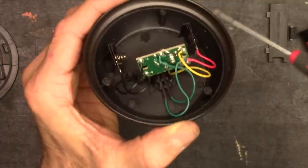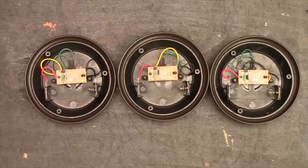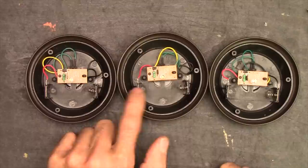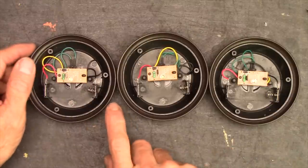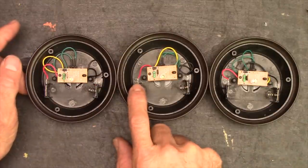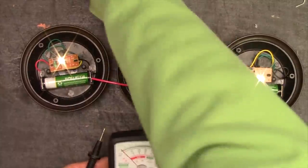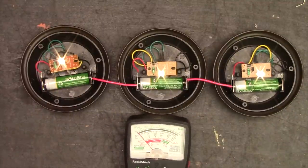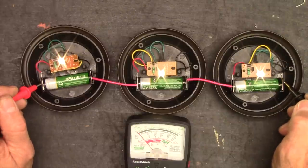What I'm after is seeing if I can take more than one of these and connect them in series. All three taken apart and they're set up so that it's positive, negative, positive, negative, positive, negative. To connect these in series is pretty simple — all we need to do is just put a jumper between negative here and positive here, negative here and positive here. I've got them all connected up and the little analog meter is out, because it's fun to use analog once in a while. These are 1.2 volt NiCADs, so we should have 3.6 volts across all three of them.